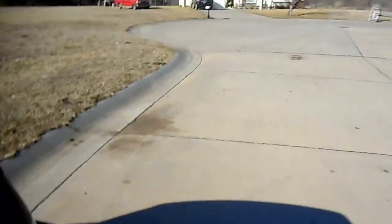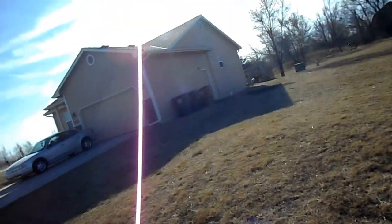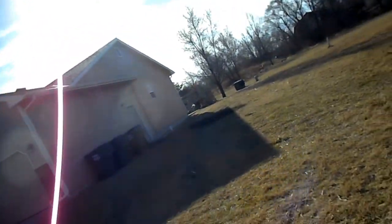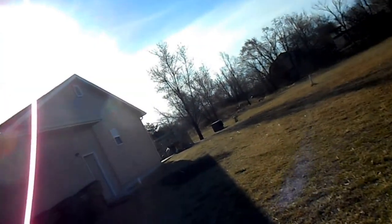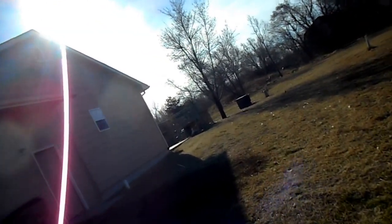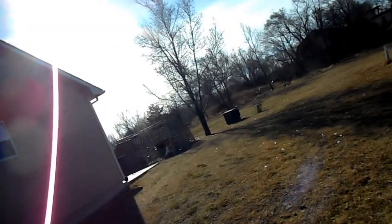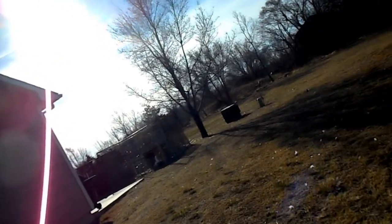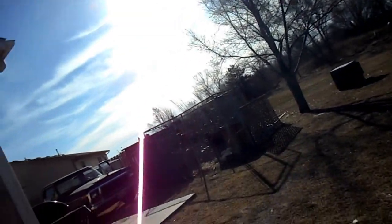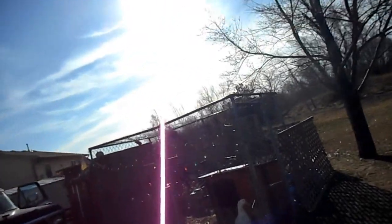It's going to be a good day. If it wasn't windy I don't even need a jacket, it's that warm. It's going to get in the low 70s, pretty good for March. So plan for the day: knock out that sheetrock, all them slats, re-sister all new 2x4s on that structure wall in the middle of the house, run it down to a new sill. Get a new wall corner stud on the other wall and maybe a floor joist depending on how it goes.